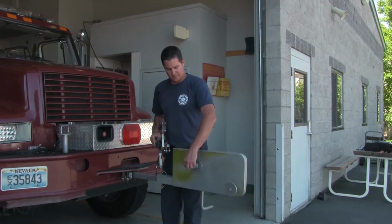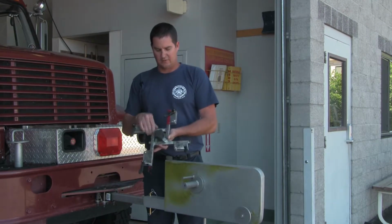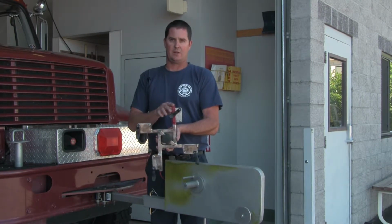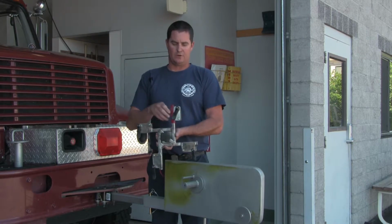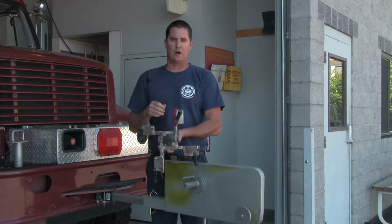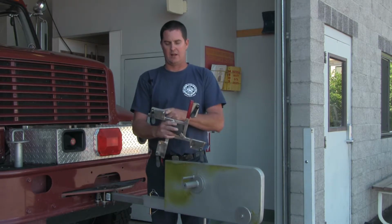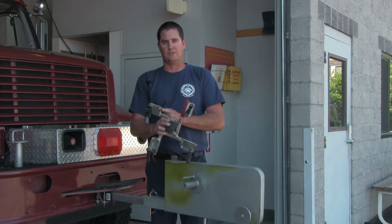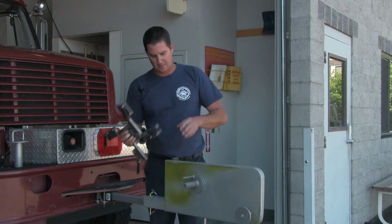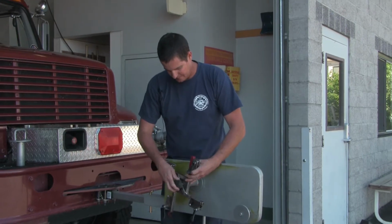big pin. The other thing that you need to be aware of is that this has spots for all 4 arms. The spot that is painted red is adjustable to allow that arm to come up and down so you can get your hose off once it's rolled. The others are fixed. So it will not allow your arm to go any lower than it needs to be because our packs need to be packed at 48 inches. We're going to line it up.